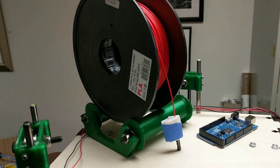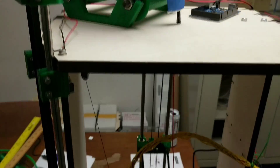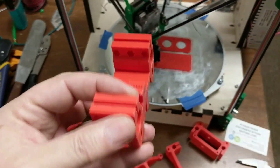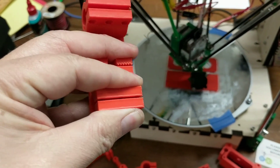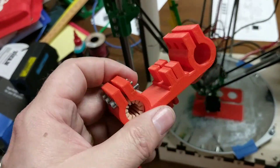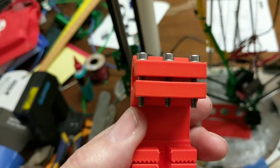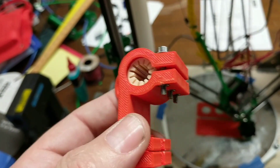We're running a newer model type PLA that runs at a slightly higher temperature — 205 to 225 degrees — and it seems a little more flexible. If you look at the clamp blocks, I can flex them very easily. On the old PLA I used to use, that would crack if you tried to do that. You can see the bearing mounted inside, which gets squished down with three M3 nuts and bolts.